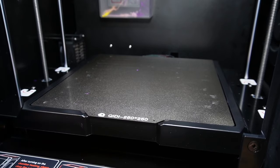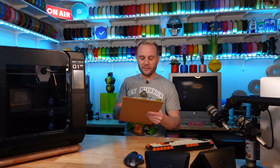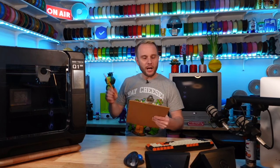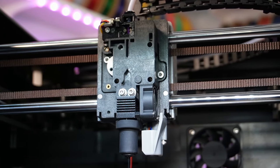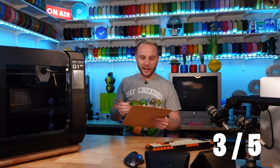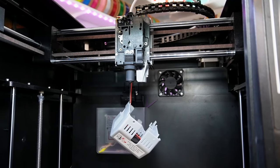The heated bed gets up to 120°C and the standard build plate temperature is about 100°C, so instead of a three out of five for being average, this one gets four out of five. The extruder — they market it as a really special extruder, but I think it's just an average extruder and I don't see any reason it deserves more than a three out of five. The hot end is not a quick-change hot end, but it is the new cartridge-style hot end; since almost all 3D printers are going that route now I put it at three — it's two bolts and pretty quick to change.